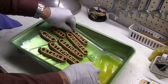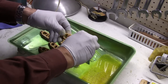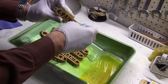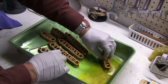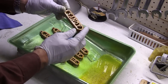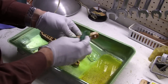Now I've poured out the boiled linseed oil over these pieces, and I'm just going to take a rag and make sure that each piece is thoroughly soaked on both sides. It gets into all the pores, into the nooks and crannies and all that good stuff. I can take this deeper reservoir and actually put it in there and flip it. Once I've got them dipped and I'm confident that everything has been coated, I'll just set it aside and move to the next one.